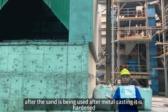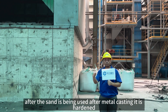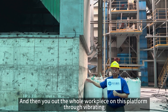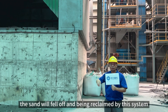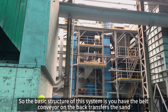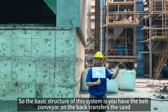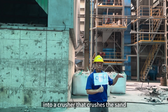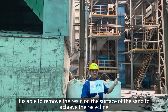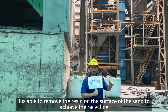After the sand is used with metal casting, it is hardened. You put the whole metal casting onto this platform, and through vibrating, the sand will fall off and be reclaimed by this system. The basic structure is a belt conveyor on the back that transfers the sand into a crusher that crushes the sand, and then through frictional motions, this system is able to get rid of the resins on the surface of the sand.